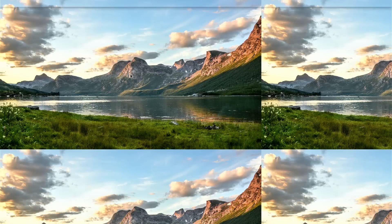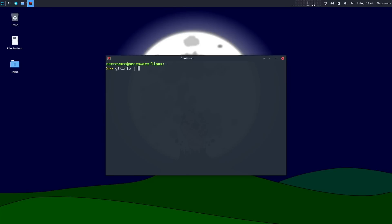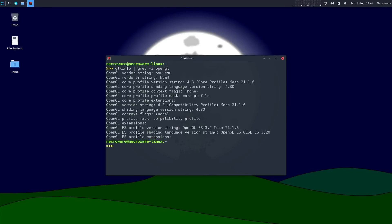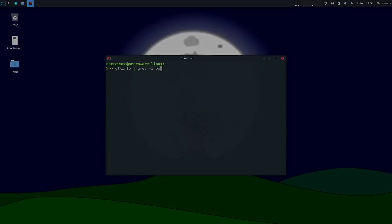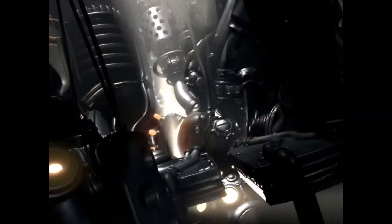My Linux setup has only the open-source Nouveau drivers which don't ramp up the clocks — they are too slow and wouldn't stress the graphics card sufficiently. I'd like to make some stress tests and put as much load on the card as possible. After a couple of minutes I installed the closed-source NVIDIA drivers version 470.57.02. Time to make some tests.